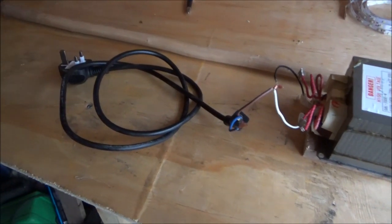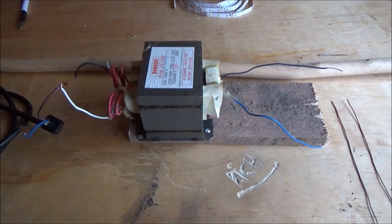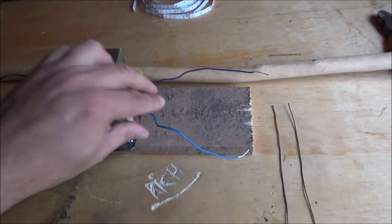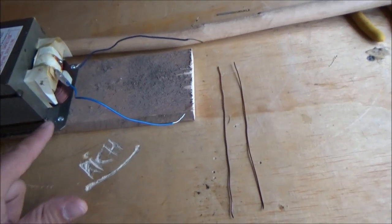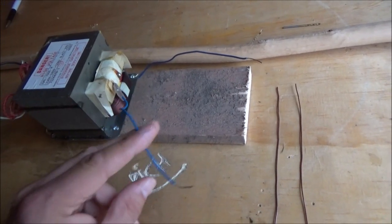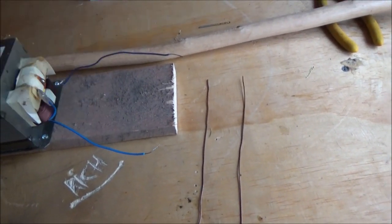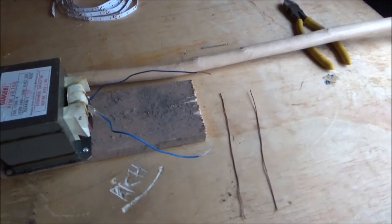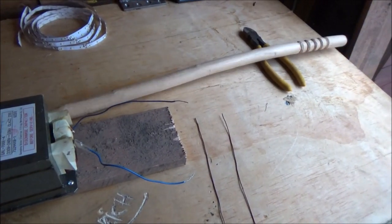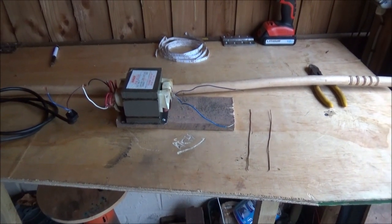Okay, what have we got? We've got a mains cable that needs wiring up. We've got the high voltage microwave transformer that was removed from the microwave. We need to connect those up and obviously insulate them. We've got a couple of cables — one connected to the chassis of the microwave transformer, the other connected to the center tap of the high voltage coil. We've got a couple of bits of metal — need to drill a couple of holes, stick the bits of metal out. And we've got an extremely long stick with a little bit of metal on the end of it, which should be relatively insulated, to encourage the Jacob's Ladder to do its thing.